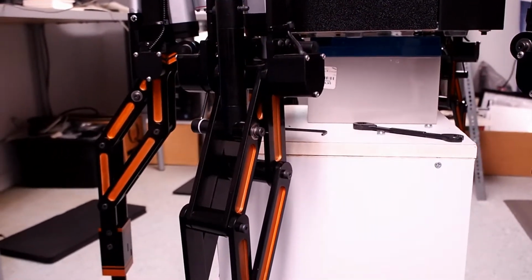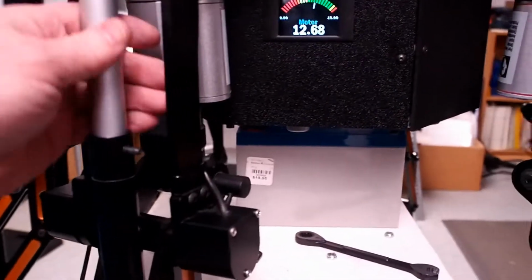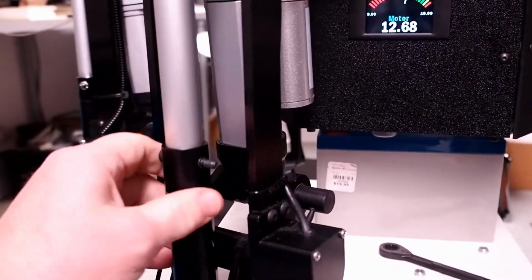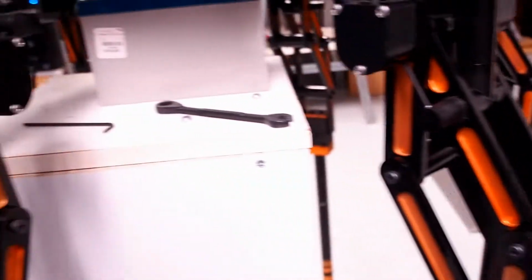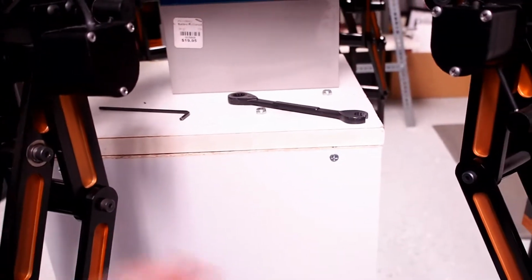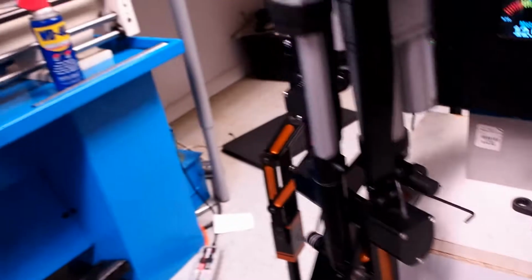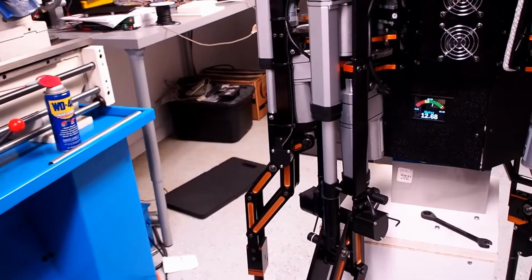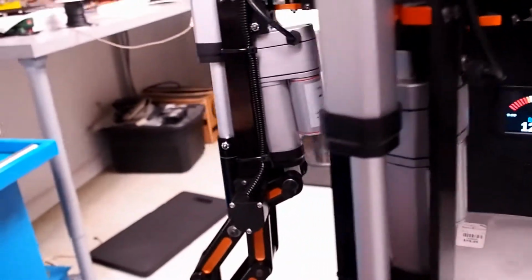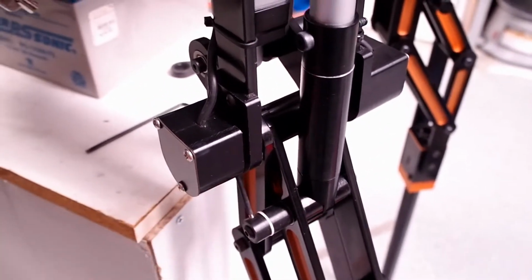The calibration process basically involves just going back and forth, changing how far this shaft is extended, and then seeing whether or not it's solid on the ground and it hasn't caused the other 2 to loosen up on either side of it, which tells me all 3 of these together are even, and if you go all the way around, all of them would be even. But it's a lot of back and forth, plus the calibration on the encoder changes because the angle becomes different. And here's the encoder right here, and the angle that it's measuring changes as we go along.